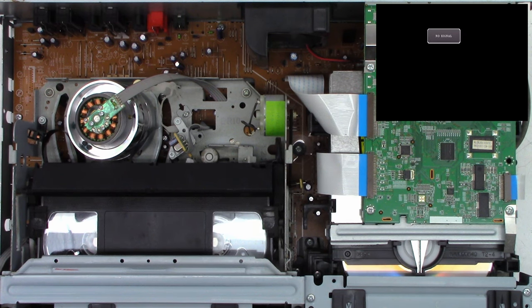Of course, the replacement cap hasn't been formed yet. Okay, let's just go ahead and replace that problematic 4700 at 6.3. Unsoldered, it fell out. Brand new. I think this is a Panasonic going in. Make sure you get your polarity right. The negative always goes towards the dot.